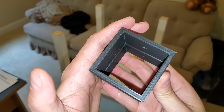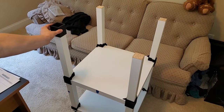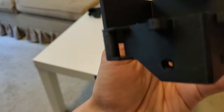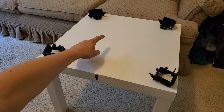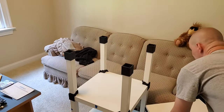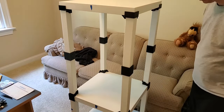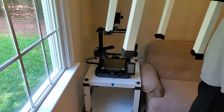To connect the legs end to end, I designed these couplers. There's a wedge-shaped ridge halfway up the inside to act as a stop. This is the third table. My enclosure will have a door on two of the four sides. This version of the connector has a cylinder that will act as a hinge. These four connectors slide up the legs and sit at the top. Here they are installed with four screws each. With all four couplers in place, I can drop in the third table. I pre-drilled all eight holes for each coupler and drove in the screws.